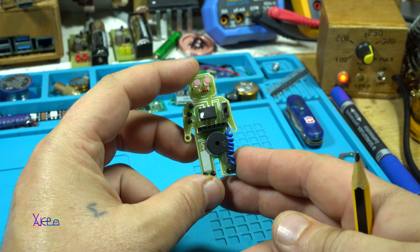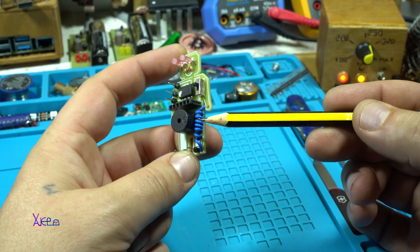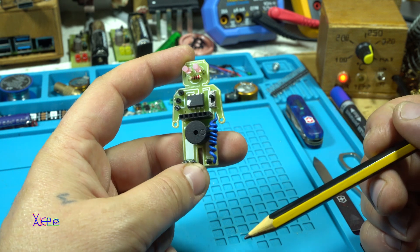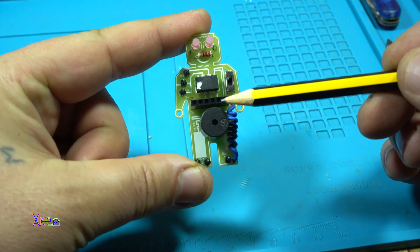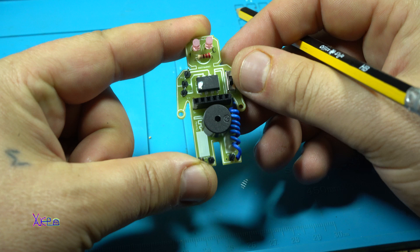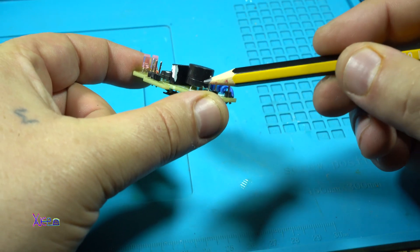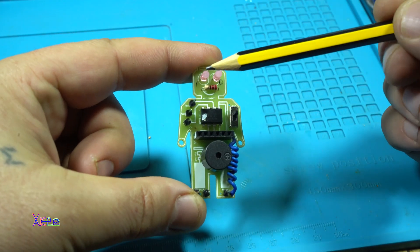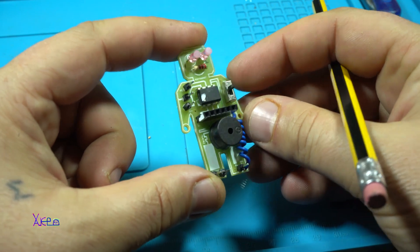Here is the guy already assembled and all components soldered, with some nice details like this wire. I have soldered a couple of connectors for pinouts. Here is the microchip ATtiny85, this is the programming connector, buzzer, and a switch — it's not an on/off switch, it's the switch for the buzzer. I have programmable pins here, here, here and here — total of five programmable digital pins. I have soldered two LEDs for the eyes, a resistor for the mouth. This is the brain of course, and it turned out pretty cool and I like it.